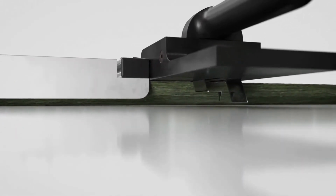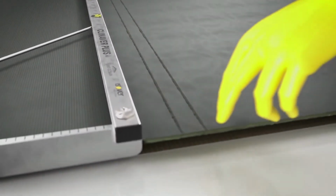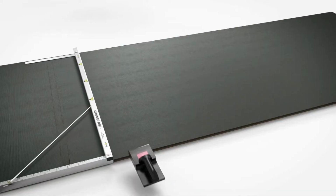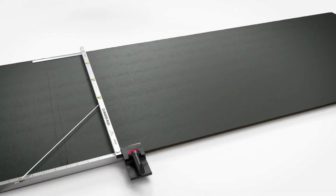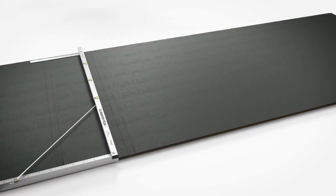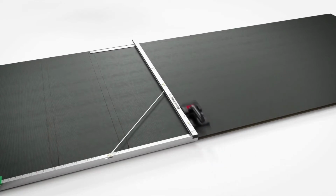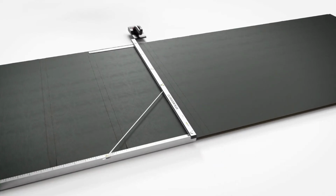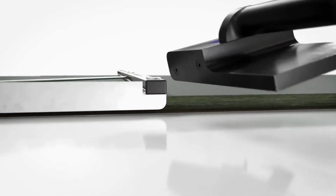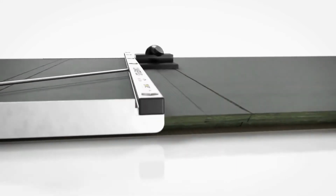The cutting excess first remains in the panel and is only slightly pressed in for a better orientation for following cuts. In this way, starting from the left, a total of 3 cuts are made with the red tool. The Climaver ruler is always aligned with the second cut line of the previously created incision. The last cut is always made with the blue tool to create the required lamination overhang.